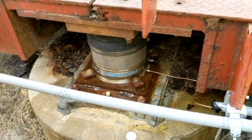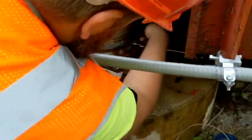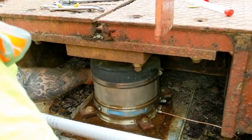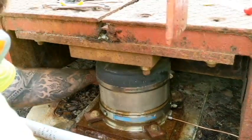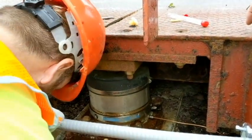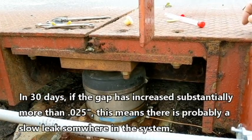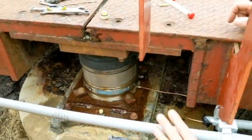It's good and tight. Now check with the gauge — see how it's snug. Check the other gauge port and the third gauge port if you can reach it. How much gap are you giving it? 30 thousandths — we gauge it for 25, pull it out and it'll be about 26 thousandths. So he hit this gauge port, came around the side to the next one, and tried to get the back one — sometimes you can't get all the gauge ports, but get as many as you can. 25 to 30 thousandths is a good number; we like to shoot a little lower. We'll come back in 30 days and recheck for leaks — that gives a little more room for pressure.